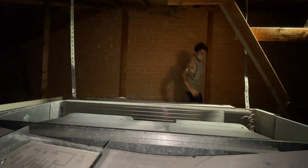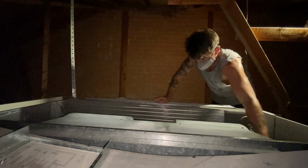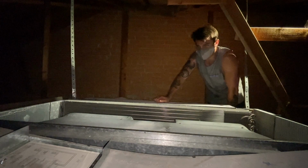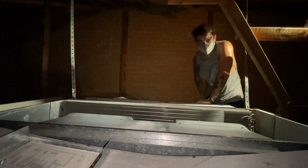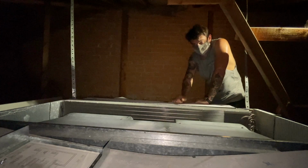So I've just taken the top off and the fan motor is not seized, but I'm going to disconnect it and go turn it on, run the whole system, compressor and everything, and if it doesn't trip out, then that confirms that it's this. Down there, I confirmed that the problem was up here somewhere, but it could be this PC board, for example. So I just want to now determine that it's this specifically. So I'm going to disconnect it and get out of here, turn it on.